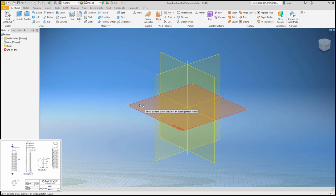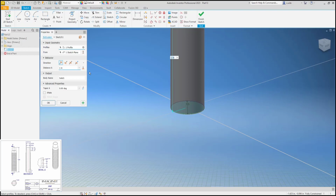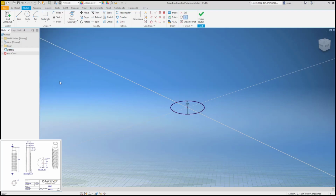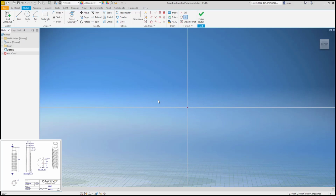I'm going to do 2 cylinders again. Thinking. Let's just get some geometry out here, and we may have to rethink some things once we get started. The overall, we're not told if that's a 45. Tell you what, I'm going to back up and do this as a revolve, because that chamfer at the top, we're not told what angle that is. I have a feeling it's a 45, but we don't know. So I'm going to do this overall shape as a revolve. Make that a center line. And then I can get this revolve done right.